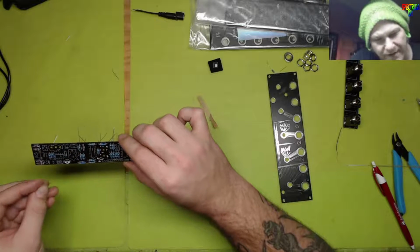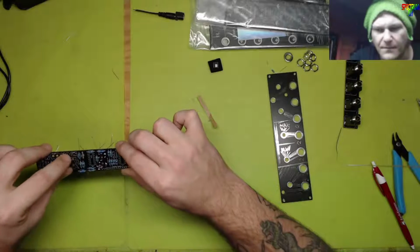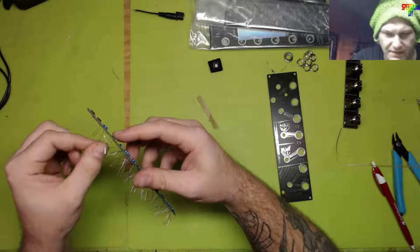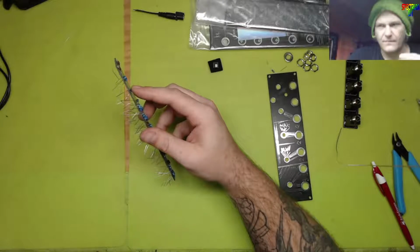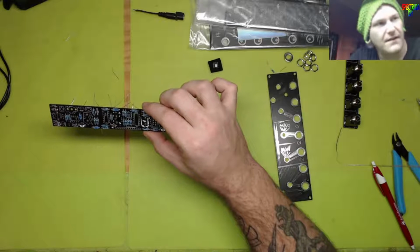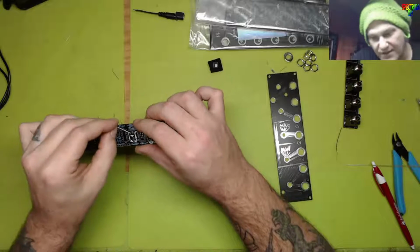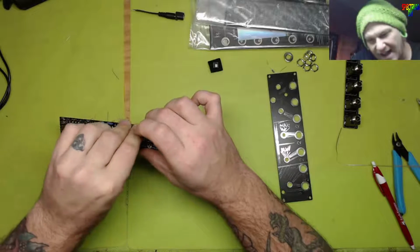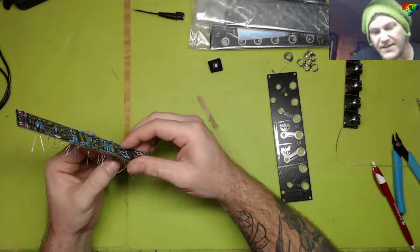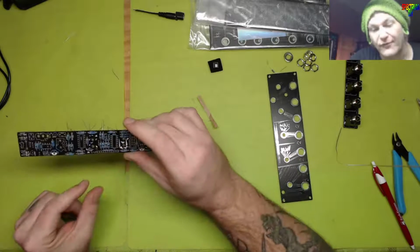After I make custom footprints for a potentiometer, I'll line the footprint. When I go to make the face panel, I'll make the face panel schematic. I'll drop the symbols and everything on the schematic file. And that forces KiCad to say, okay, well, now you've got to do a PCB design. So then I click on PCB design and drop all of the stuff just on the plane. I don't do anything with it. I just make sure that there's a completed file. And once it's all the way completed, then I exit KiCad completely. And then I'll go to the folder and open the PCB design that I just made, the blank one. And I'll hit an option called append board, and I'll open whatever's going behind it.